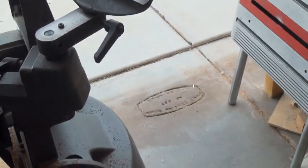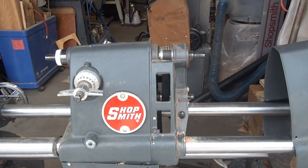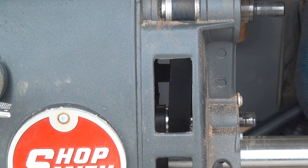So I guess the point is I'm going to open it up and take a look inside. And again, I'm just looking for some help - if you watch this I hope you can give me some suggestions or pointers. This is the first thing - I'm taking the cover off. Other than it gets kind of dirty in there, a little dusty, I'll blow that out. But I'm pretty sure this isn't right. Take a look at that upper belt - it's at an angle. It's not running up and down vertically like it should be on the upper pulley.